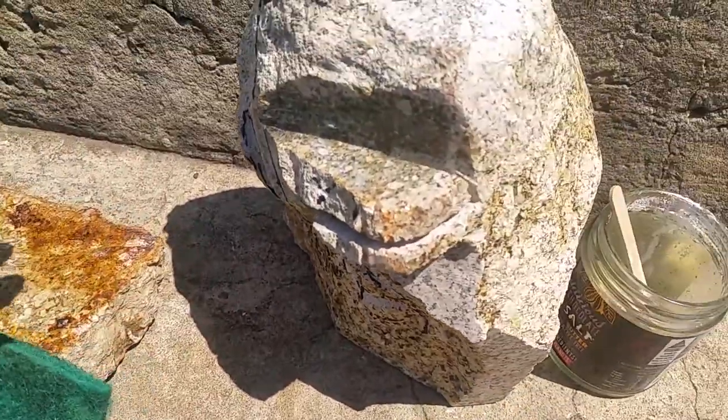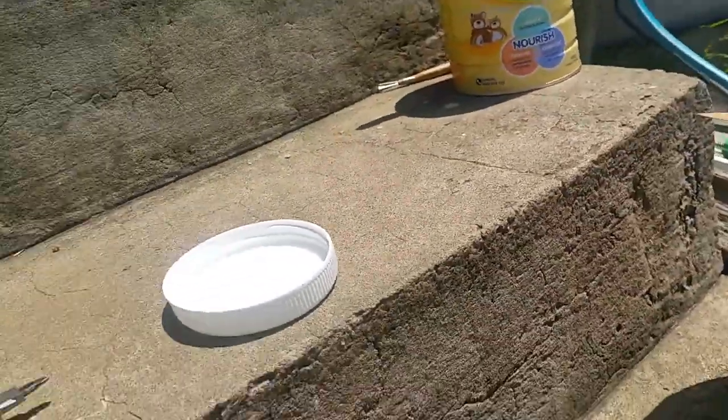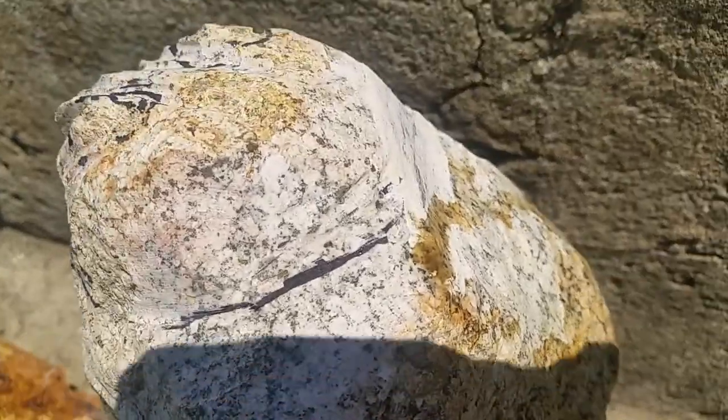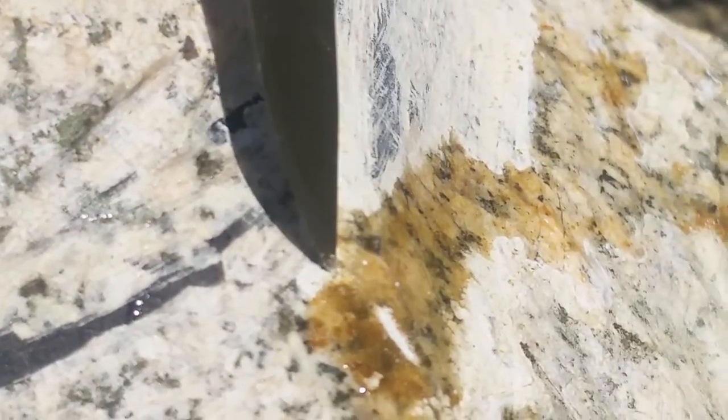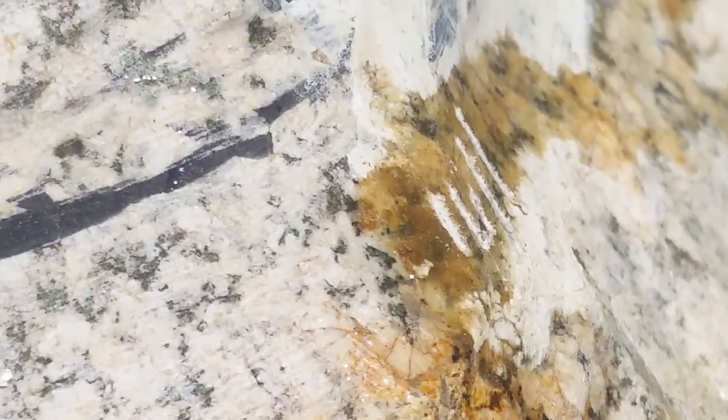Let's get this glove off because sodium silicate is a little bit on the caustic side. I wanted to poke at this glazy-looking stuff here and see what it does when we interrupt it. It's quite glassy feeling — there we go, it's coming away. Sodium silicate is a compatible material for sealing concrete, so I think over time this stuff would just get harder and harder and more mineralized.